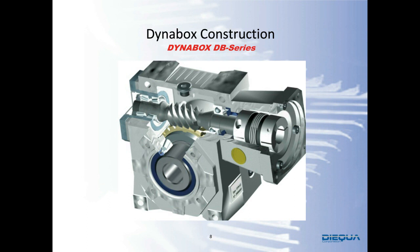Moving through the next portion of this presentation, we're going to talk about what makes this product stand apart from the more traditional industrial worm product. You can see by the cutaway that the construction is unique to other industrial worm products in the market, both in the worm and ring gear design and how we support and manage control of the worm shaft. Additionally, the zero backlash connection from the servo motor as an input directly to the Dynabox product.